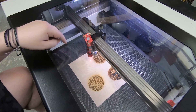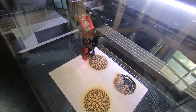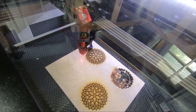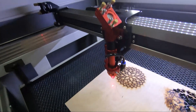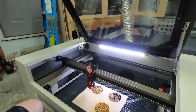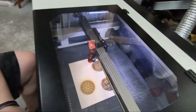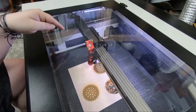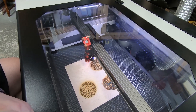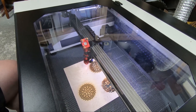You can notice that the laser beam in there is definitely not where it pulsed — might be hard to see, let me zoom in a bit. Yeah, so that is because we're not focused correctly. We're not worried about that, but we did get it to fire so everything in the laser is working correctly. Now let's try to get it focused in and then we'll attempt it again. I'm going to turn the laser off just in case, and now we can do some more adjustments.